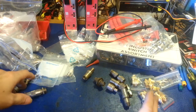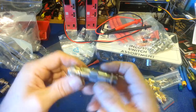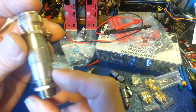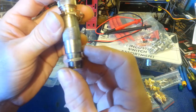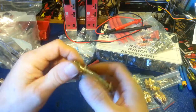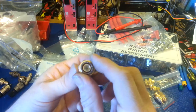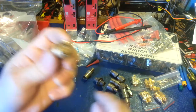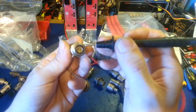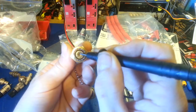The first one — I think I've figured out what this is. It's a really nice heavy-duty unit, silver-plated, got a number on it: 94375-RF-21CVA. It has a standard UHF connector on one end, but the other end is completely isolated. I checked with the ohmmeter, and the center pin contact on the other side attaches to this metal ring right here, but it's isolated in the middle.